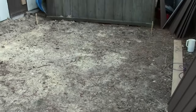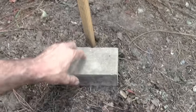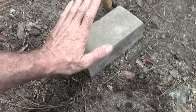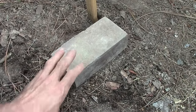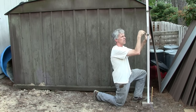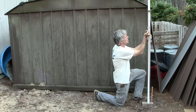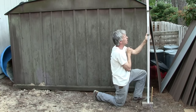There is the whole layout. Now we can take the water level and start checking out where things are at as far as the ground being level. This entire framework is going to set on bricks, not right on the bare ground. In each corner I'm going to place a brick. So what we're going to do is see just where that's at on the water level — this is going to be our zero point, this is where we're going to reference everything to, to make sure it's all the same height as this. I've got this first one laid down good and solid. I'm going to take my stick with the tube on it, just let it stabilize. Once it's stable I'm going to take a pencil and put a little line right at the level where the water is in the tube. Now that's my zero point.